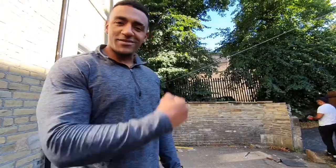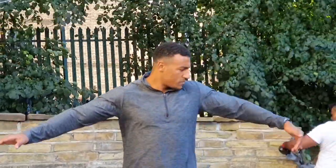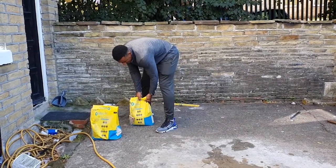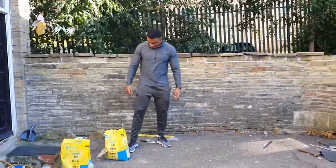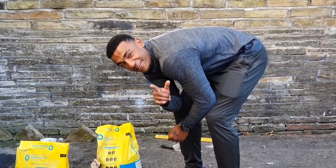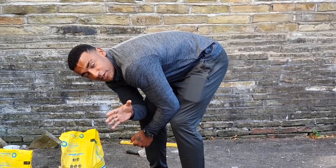So have you come to help then or what? Come to take over? Yeah, come on then, we're making that wall. How heavy do you think one of the bags is? That's a nightmare. Do you know mixing ratios? How much do you think we mix it — without reading it obviously? It depends if you've gone for soft sand, hydro lime or cement. So I'm a bit of an expert. I'd say building soft sand — that means we've done five to one. The truth is, we've done three to one though. Three to one — is that a bit stronger? Yeah, washed it too much.